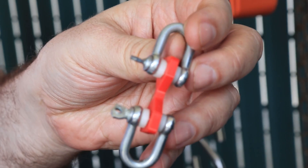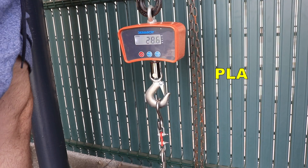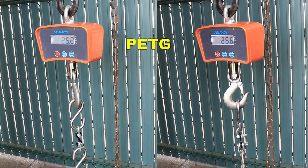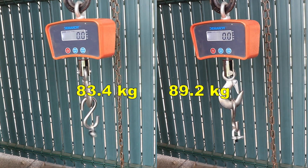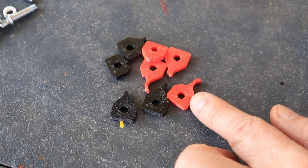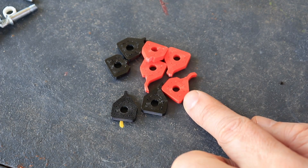It's time for the mechanical testing. This test object is printed in a horizontal position. The smallest cross-section area is 4x4mm and I'm starting with PLA. Unfortunately one footage is missing here. This is now PETG. For the feel they were very similar. I pressed the button but it didn't start recording — I was watching it though. The break was approximately at 85 kg.